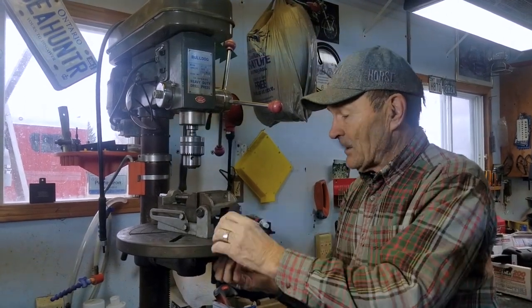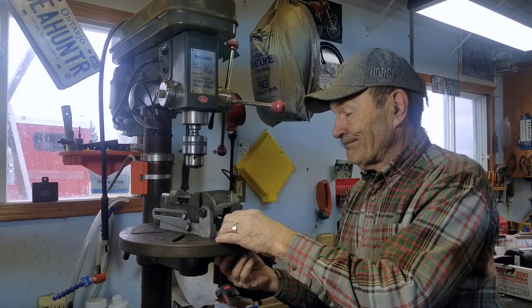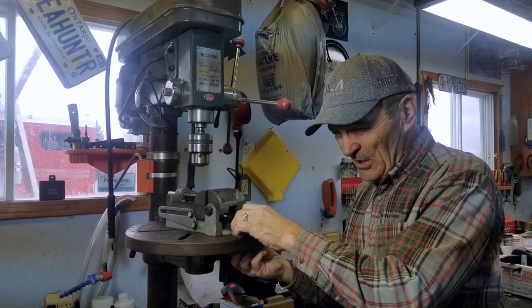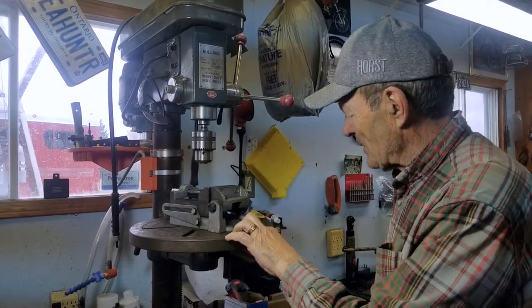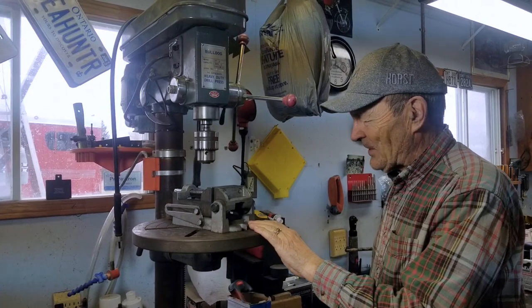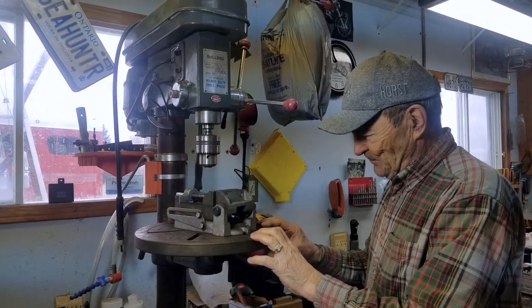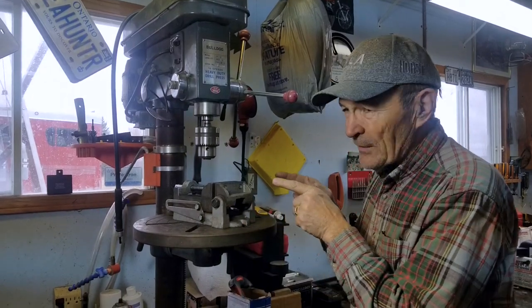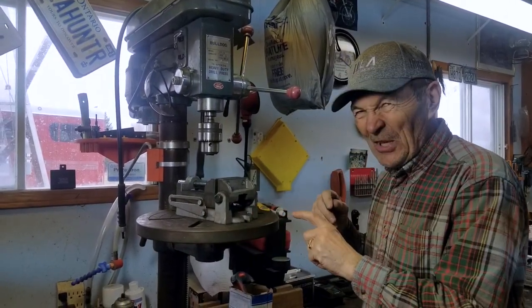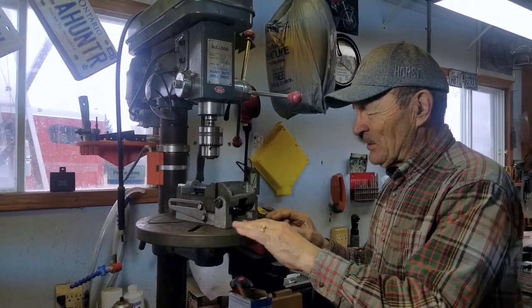And it looks like a very, very simple problem to fix. But I looked at it and looked at it and I wasn't too sure. The vise itself is cast — you can't do too much to the vise itself. I toyed with the idea of welding something on it, but you can't touch the vise. And I was going to put a carriage bolt in here, where the square section of the carriage bolt would fit into it. But there isn't really a carriage bolt that fits in there snugly — I didn't want to damage it.